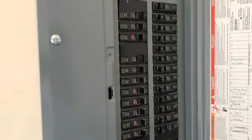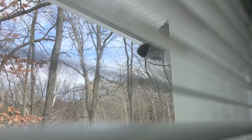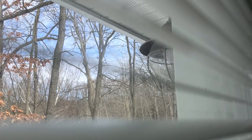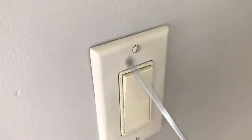We need to cut power to this switch. The light switch that we're working on is in the living room, so we are going to cut the power to the living room — that is fuse 13 in our case. Back at the light switch, I'm going to flip the switch on and off — the light no longer comes on.